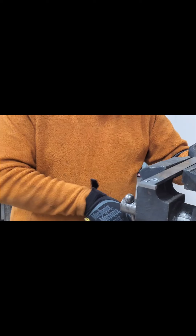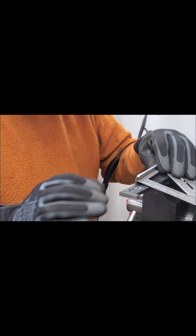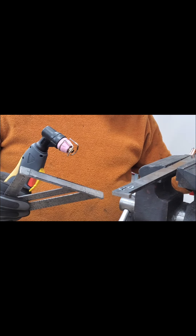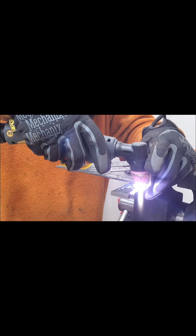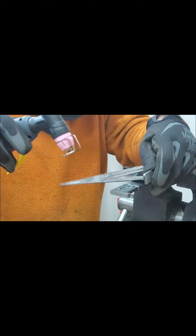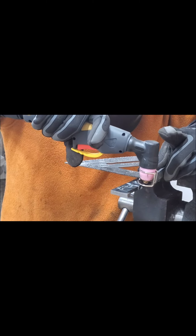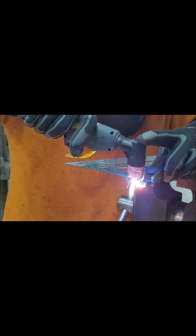Let's try this quarter-inch powder-coated material — maybe we can make a straight cut with this. Even though this is coated material, you still need bare metal to ground the material. I got it. It needs a little practice, but I got through it and made a pretty nice cut, all things considered.